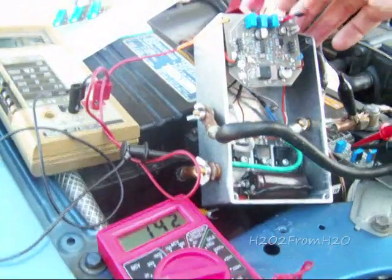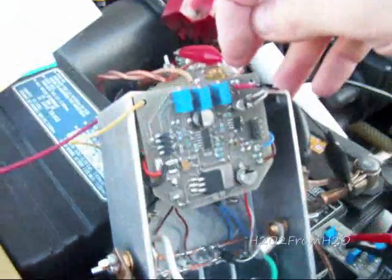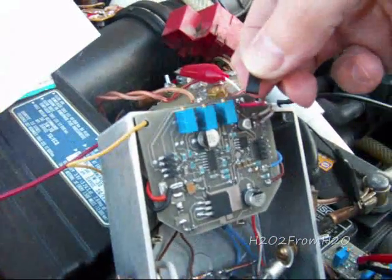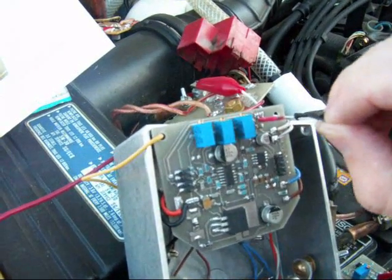This is the current override. There are two pads here on the board. I've soldered two wires to it and used a simple jumper — it's got a metal inside to jump with the two pins. I'm going to attach that onto there and we're going to see what happens.